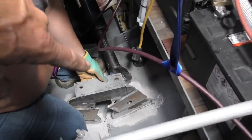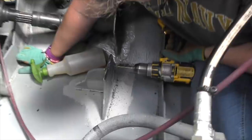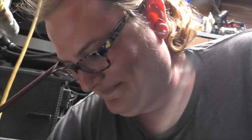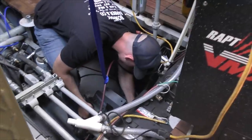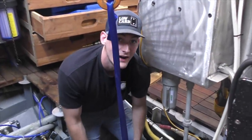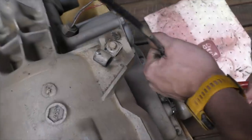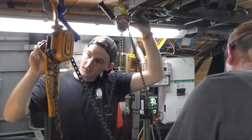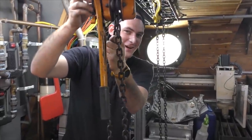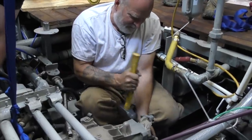You line up the two that got cut, then get a marker and draw a line up from the bottom to the top. Jake shows up — he was driving down the highway, looked over, and saw the boat. The consensus on the cable on the side of the transmission is the kickdown cable — it was hooked up to the throttle cable, and when you throttled down hard, it made the transmission drop to a lower gear. But we're just going to shift from reverse to neutral to first gear. We never go to second or D.